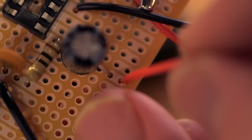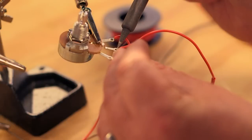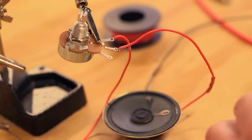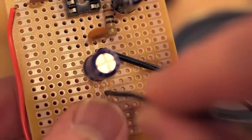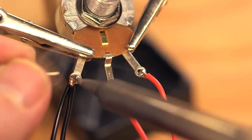Connect this row to the right terminal of the 25-ohm rheostat. The center pin of the rheostat connects to the positive terminal of the speaker. Now connect the ground of the speaker and the ground rail of the circuit to the left terminal of the rheostat.